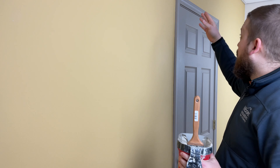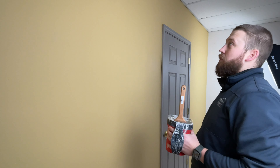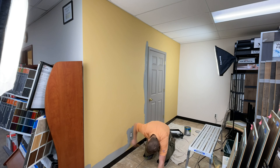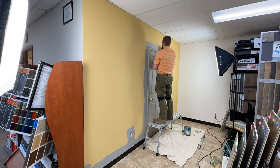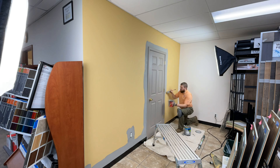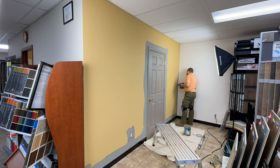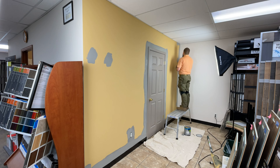When coming in and assessing a wall or a space that you're doing, after you've sanded and you've got everything ready to go, the last place you want to cut in is at the top. That's immediately where the eye is going to go. So when you go into a room, you want to do your base first. You never want to go too far into a project because you don't want to get hat banding, so you want to do one wall at a time. The last place you want to cut is at the top so that you have that wet edge.